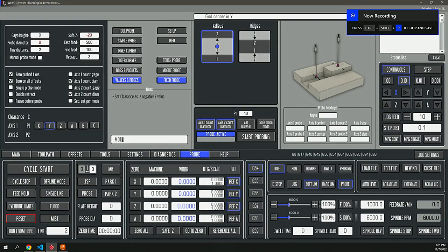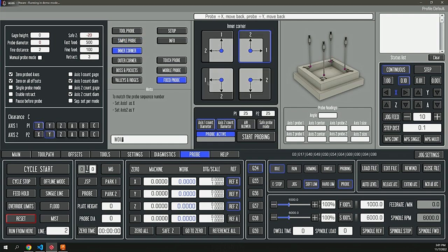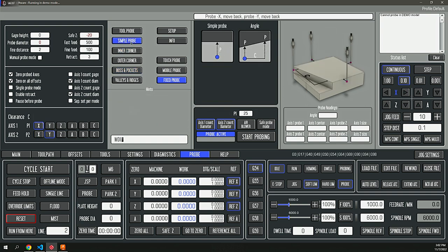Now in this case, the 3D probe was primarily going to be used for inspection or stock indexing. UCCNC has lots of capabilities to probe using a 3D probe, whether it's the external corner or an internal boss or feature of your part or a bore, it will provide all of that capability for you. You just have to enter a few parameters so that it knows which axis you're dealing with, from simple to complex probes. The functionality requires a little bit more thought when you're leveraging it so as not to perform the wrong axis or operation or depth of probe, but the flexibility is priceless.